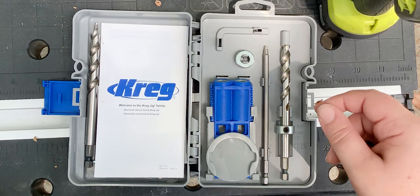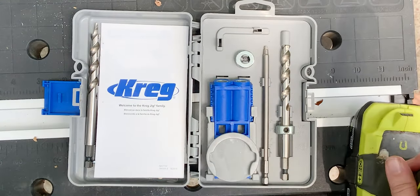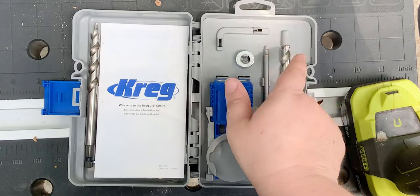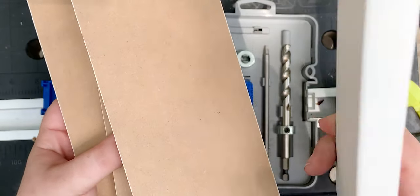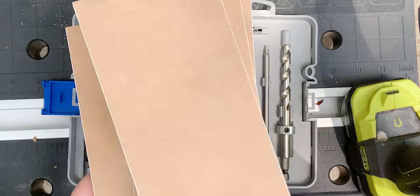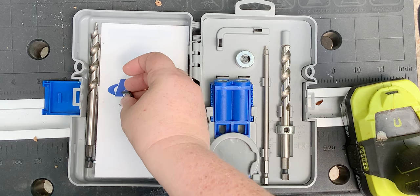So either way, we're gonna get started. If you want to know all of the cut lengths or the materials that you need for this project, I will put all of that down in the description. So I'm going to make a box today with a few 1x4s and some plywood. The first thing I'm gonna do is add pocket holes — I've already drilled one just to make sure I've got everything set up properly. There it is: one pocket hole. We're going to do that to all of our side pieces and all of our long pieces, and I will show you how to do everything.